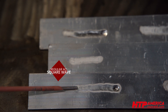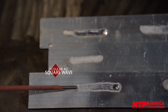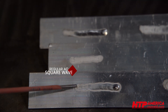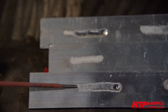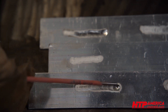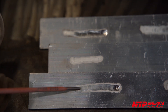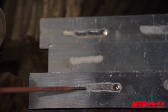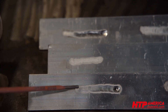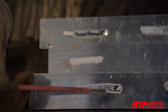Okay, what we have here is your regular AC square wave weld: 40 hertz, 75% EN, 110 amps on some eighth-inch material. This is without any filler rod — yes, there's a crater crack, I didn't taper off or dab any filler in there. But looking at this, it started out all right, it's pretty flat. Other than the crater crack, there's no real defects here. You have a little bit of frosting and a cleaning zone around it.